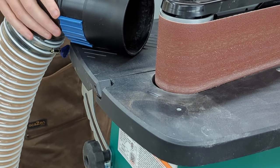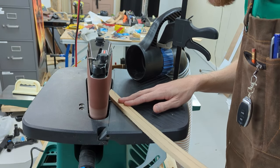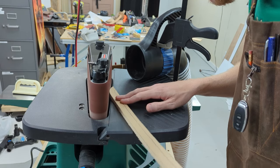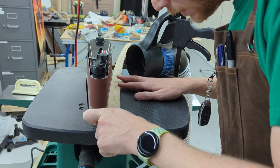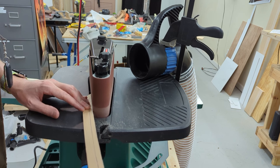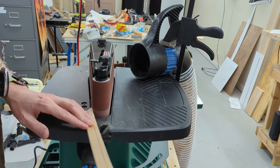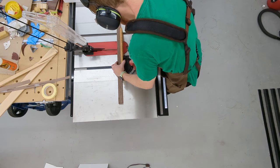After cutting, I set up my belt sander to refine the shape of the blade and sand right up to my line. It's easier to finesse the shape using the sander, because it is a much more delicate process as opposed to going at it all barbaric-like with a spinning steel blade. It's a slow process, but I take my time and sneak up to my pencil line. Since the blade is curved, I use both sides of the sander to avoid any divots. This may not be a best practice, but it works.